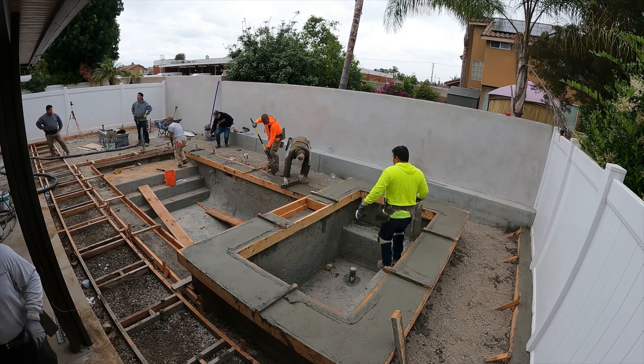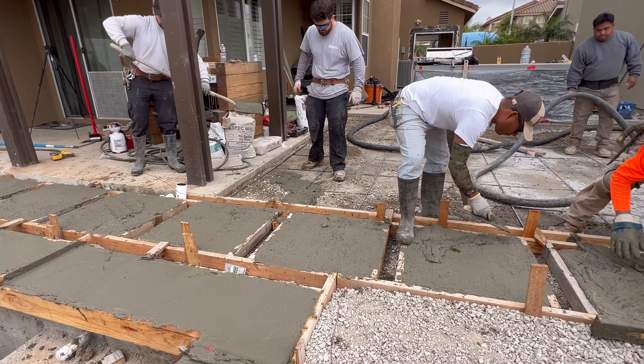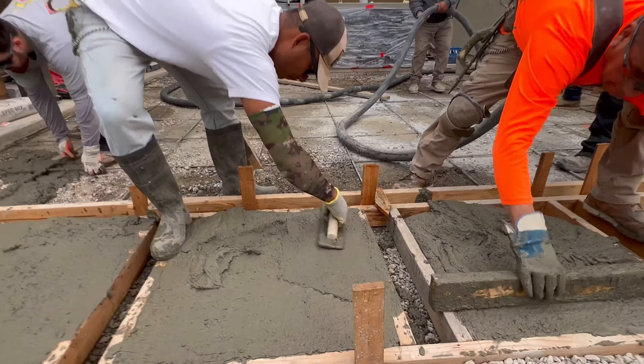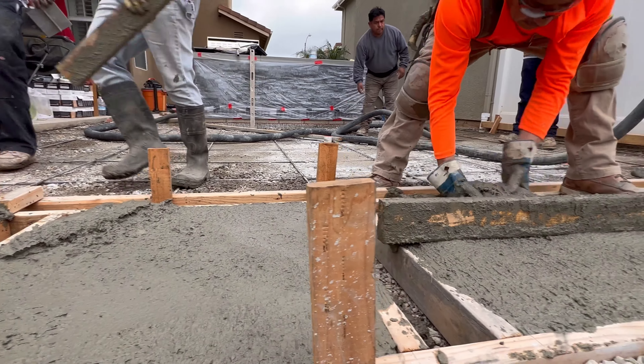As you can see, we have the coping. We have some stepping pads up here to the front and left, and off to the right we have a curb that we poured on both sides. That's because we had a little bit of an elevation difference on these yards — the neighboring yards are quite a bit higher, about six inches, from our customer's patio height. That curb is just going to help a lot with keeping water and runoff out of our customer's yard.